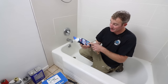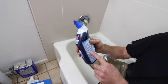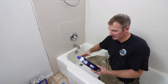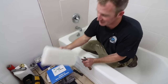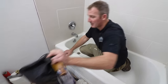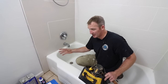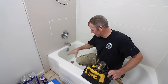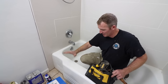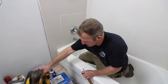Another important thing is cleaning. I'm using Lysol Power Toilet Bowl Cleaner because it actually etches the tub — it's a very strong cleaner and we're going to clean this tub thoroughly before we get started. I also have some white scrub pads to help with the cleaning process, and a palm sander with 80-grit sandpaper to get any gunk off. The most important thing you can do is get this tub clean and ready before starting any applications.